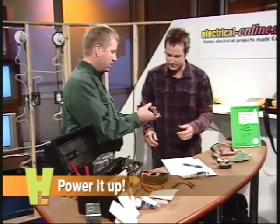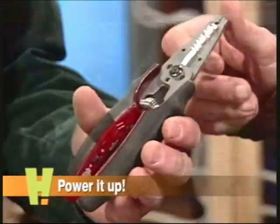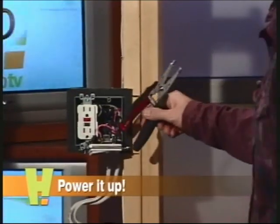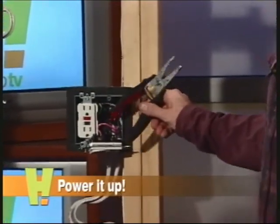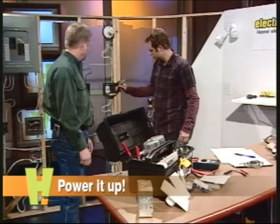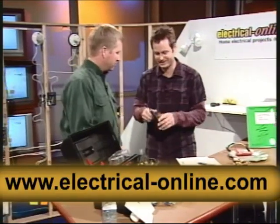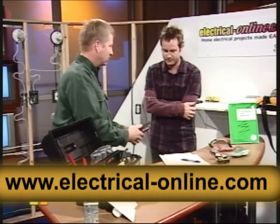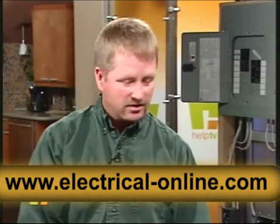You can also move into a non-contact voltage tester. These are nice. I found a pair of wire strippers that have a non-contact volt tester built in. If you just bring it close to a hot wire, it lights up and chirps — just from being close to the inductance of that hot wire. The only problem is they can be a little sensitive. You can rub one in your hair and get it to light up from static, so you want to make really sure the power is off.